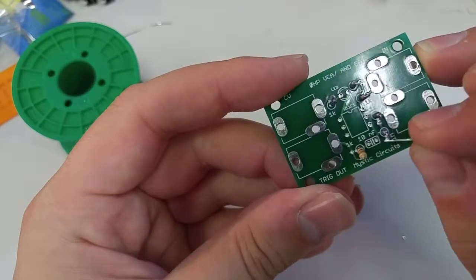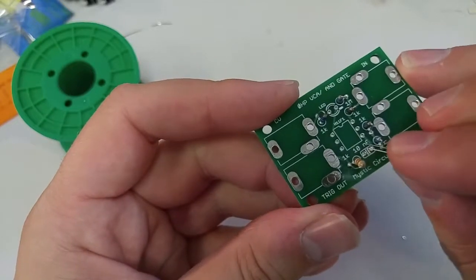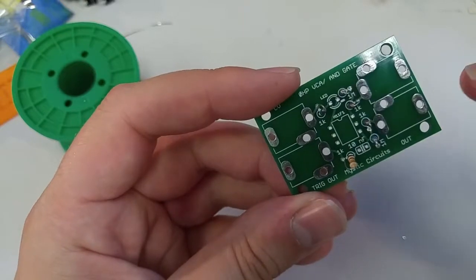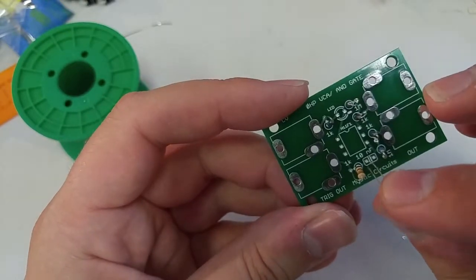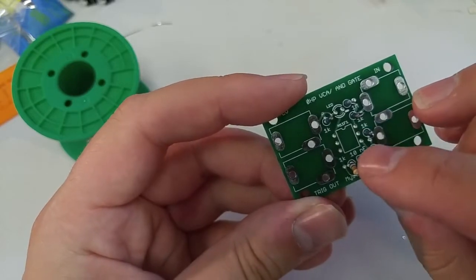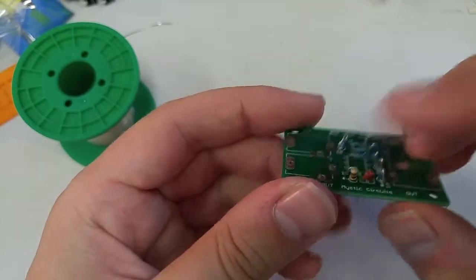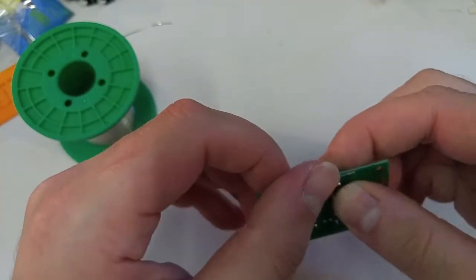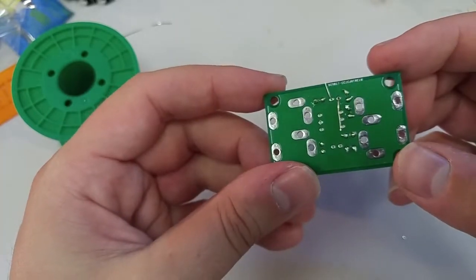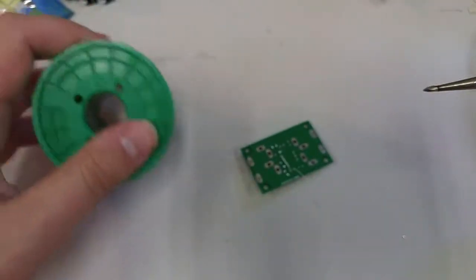There's this little square, it's a rounded square, labeled 10 nanofarad. 10 NF stands for nanofarad. So the capacitor's two legs go in the two holes that are inside of the square, right? So you can see the capacitor's shape mimics that of the square. Fold our legs over, I'm going like this to avoid any nearby pads that could accidentally accumulate some solder.